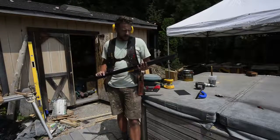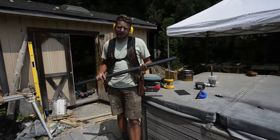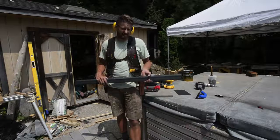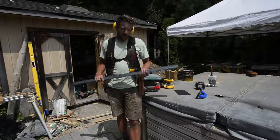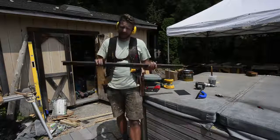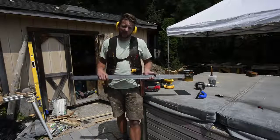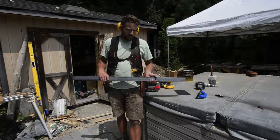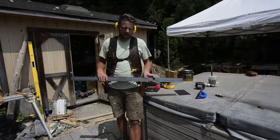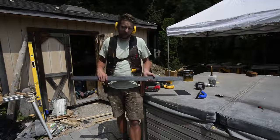Well, I'm about to venture into uncharted territory yet again. It's just what the samurai does. But this time, it's out of necessity, because the door that I made out of a live edge slab of wood that I cut up a couple years ago and had been drying underneath the deck, well, the slabs weren't dry. I made the door, put a coat of poly on it, installed it, and now it's starting to cup, which I kind of saw coming, but was just hoping for the best.